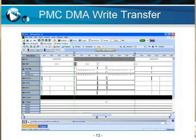Why don't we achieve those maximum theoretical data rates? With the PCI bus you must arbitrate for the bus to gain access to it. When a DMA transfer begins, you must first get access to the bus and that time is wasted. And then in the middle of moving that data, you'll see pauses because the bus has to be given up for other operations — other boards in the system that need to temporarily use the bus — and so all of these take away from achieving your absolute maximum theoretical data rates.